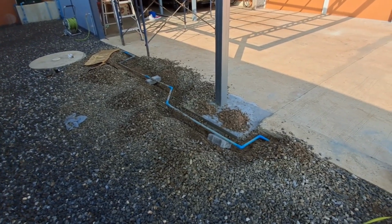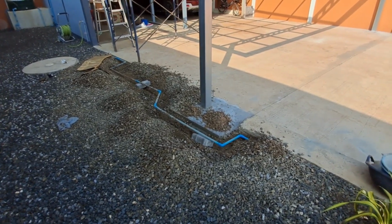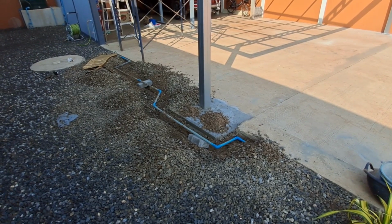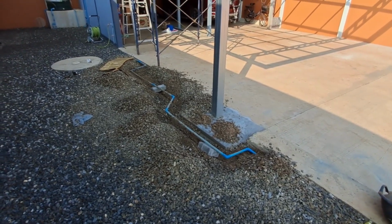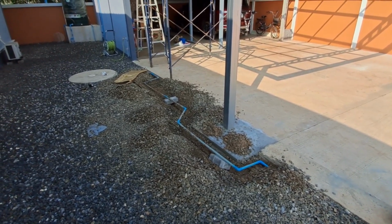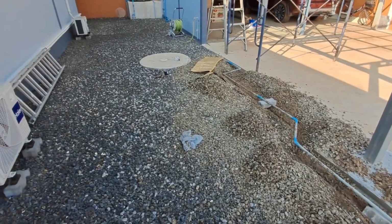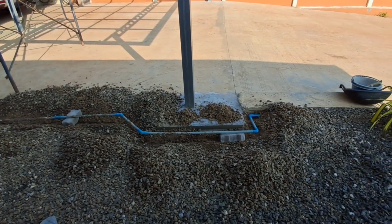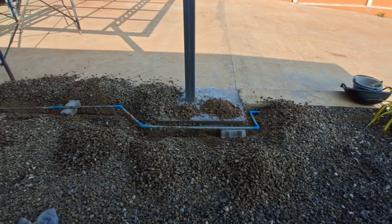So I'm assuming that it's one of these joints that I've done, because it wasn't a problem before then. So it'd be rather a coincidence, I think, if it's not one of these joints. So I've started the process of elimination. I've gone around and I've made sure all the taps are off, that nothing's dripping in that sense. And I'm waiting for the next cycle to happen, which will be the second one since I've dug this pipe out and cleaned around the joints.